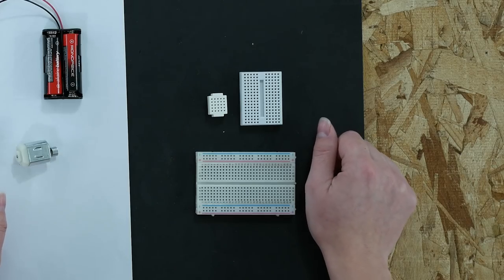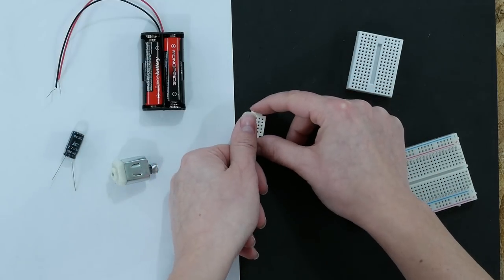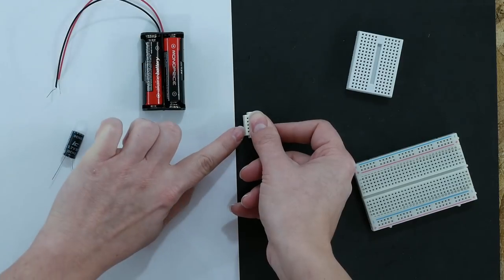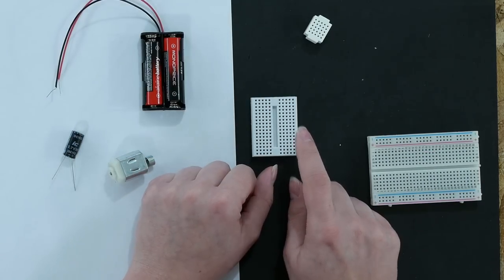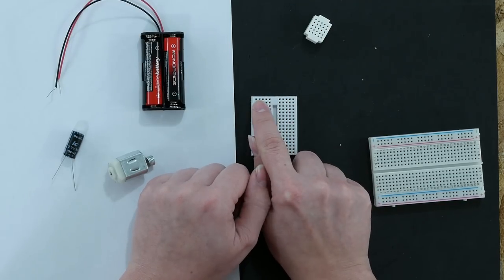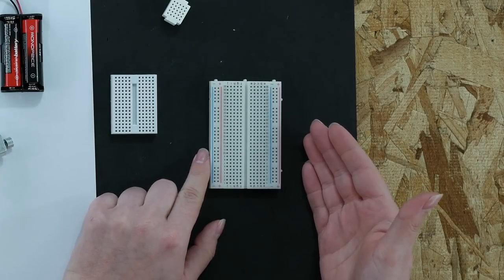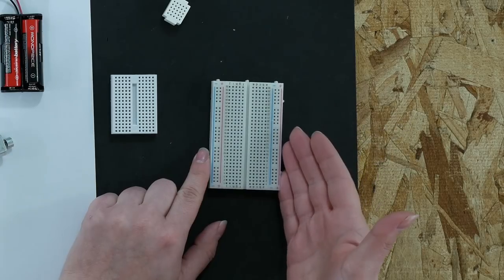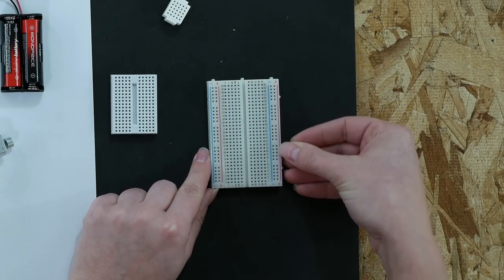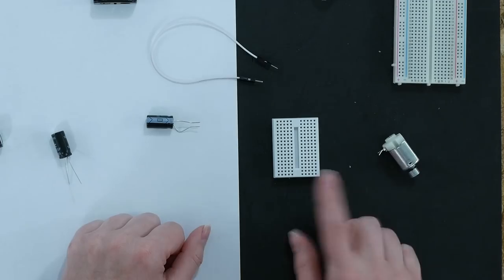We're gonna build our circuit on a breadboard. Let's review how those work. Here are three different breadboards. For this tiny breadboard, if you look really closely you can see a 1, 2, and 3 at the bottom of three of the columns. What that tells me is that each of these columns is connected, so if I were to plug something into any of these five holes they would be connected to anything else plugged into those holes. On this breadboard it goes by rows — these five holes are connected on the right side and these five holes are connected on the left side, but the left and right sides are not connected. This is a more traditional breadboard that has power rails on the side. All of the holes in the column next to the red line are connected, and all of the holes next to the blue line are connected. Those are intended to be used for power and ground.